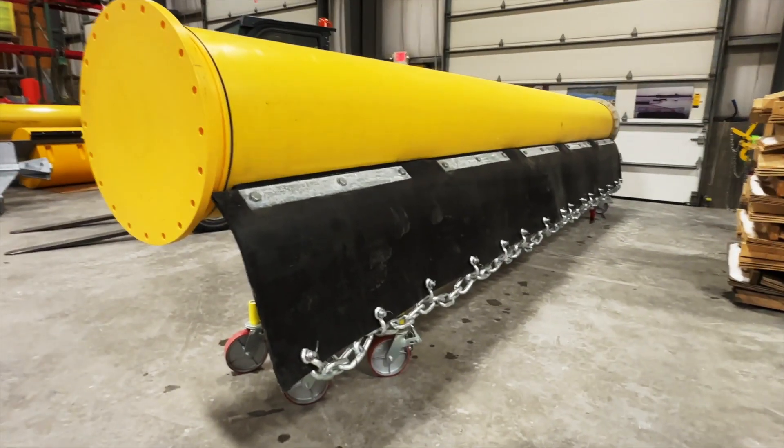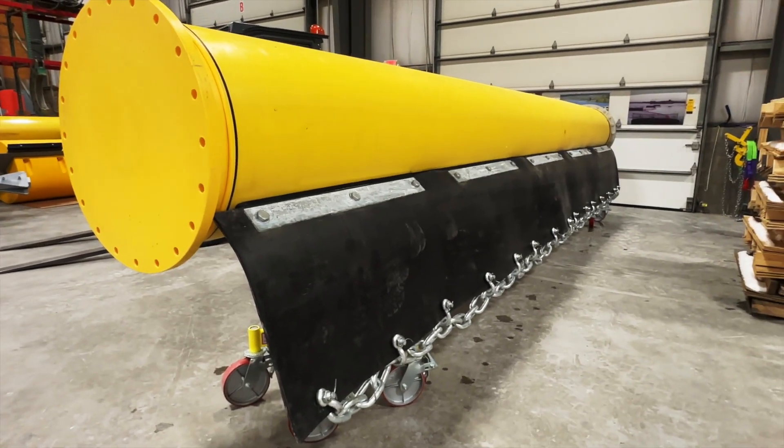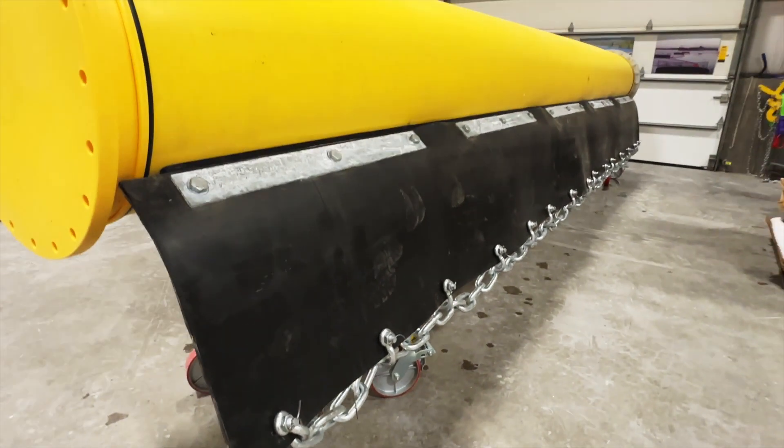In this case, we have attached a 24-inch rubber debris skirt underneath the boom. We get rid of the metal skirting. We weight it down with heavy chain and shackles to make sure it doesn't flip up in high currents.